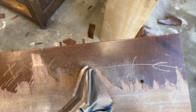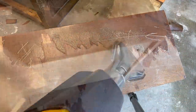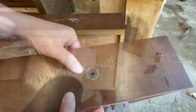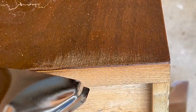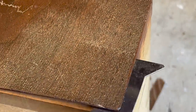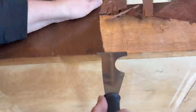You can see how that old varnish is bubbling up and turning whitish, which makes a helpful roadmap of where you've been. After heating up a section I carefully used my utility knife to get under that veneer and pry it up. I thought maybe the two smaller top drawers could keep their veneers, but upon closer inspection they were also starting to crackle in the center, so I used my heat gun again, focusing the heat blast on those corners to get my knife in and under.